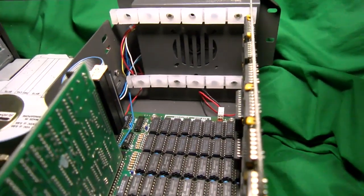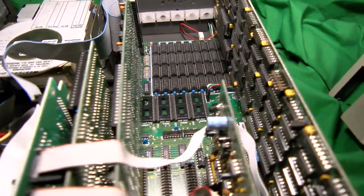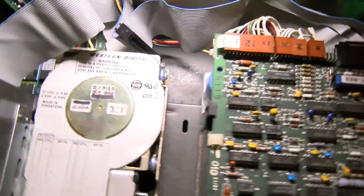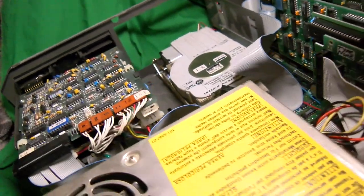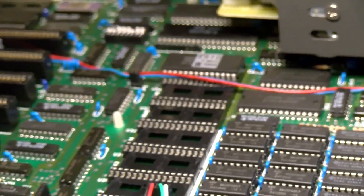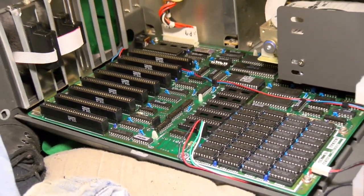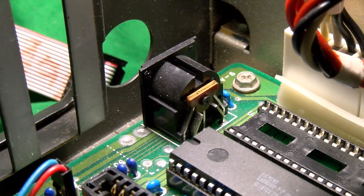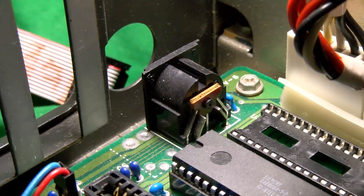Also, we only have 8 IRQs and 4 DMAs, and we can't even use some of them. Several are either used by the system or assumed to be a given thing, which might not be a bad thing, depending on how you look at it. The 8253 is on IRQ0, and it acts as a system timer, as well as driving the internal speaker. So we can't use that IRQ for any add-ons, and we can't really run the system without that component. It's not even socketed. The keyboard lives on IRQ1, and yeah, we can't do anything about that.